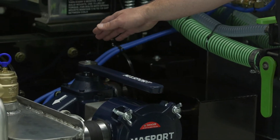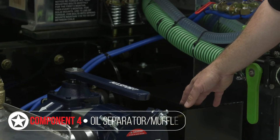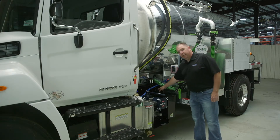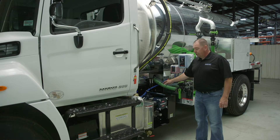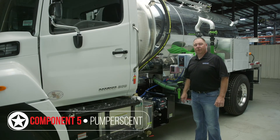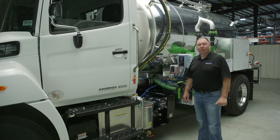From the pre-filter, you go into the valve of the pump, and on the back side your exhaust goes into an oil catch muffler or oil separator. The oil separator catches waste oil from the vacuum pump and quiets the pump noise. The exhaust hood vents to atmosphere, so make sure that's in a clean, clear place out of the dust and dirt, because when you're running in pressure mode you're sucking back through the system. Some trucks are also fitted with a pump scent deodorizer can — this particular truck is not, but we'll look at that later.